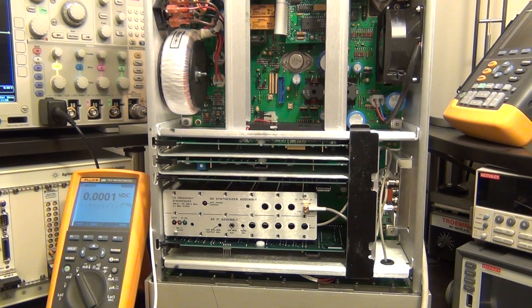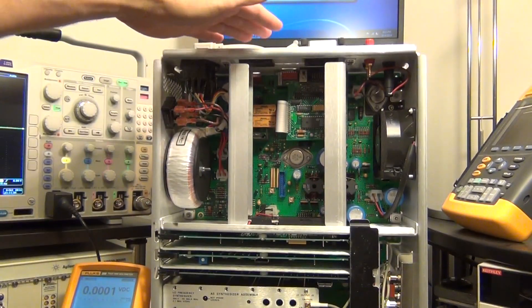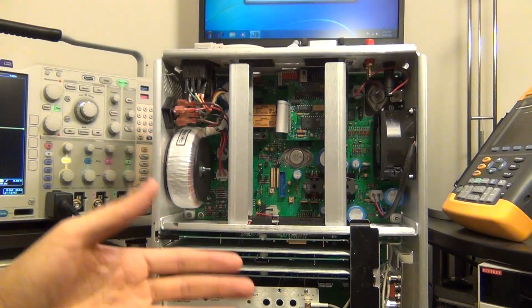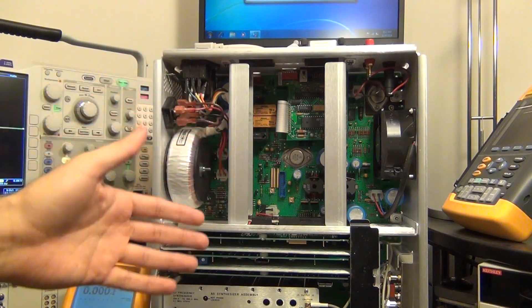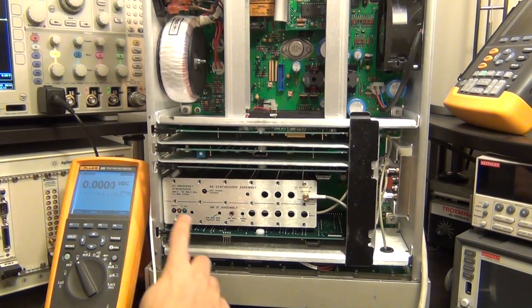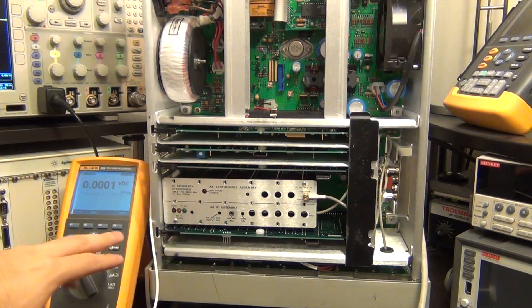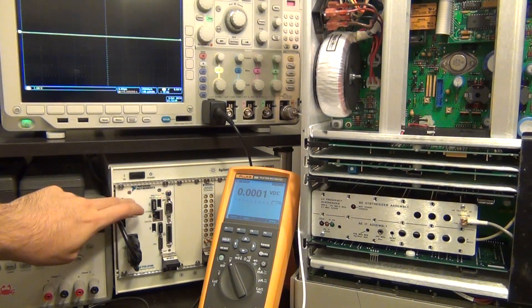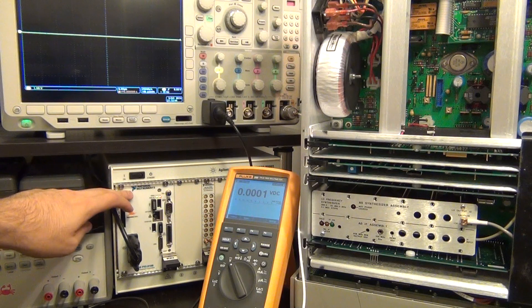You understand what it's doing based on what we discussed — the frequency is rapidly going back and forth, looking for a possible RF frequency to catch. Look how fast this MDO works. Because it's capturing such a wide bandwidth, it's not sweeping in this range — it's all one capture, so it's really, really quick. So you can see it going back and forth — it's working really well. The amplitude is reporting around 13.5 dBm, which is also correct — it should be 14 dBm. The best way to confirm is to invoke the diagnostic GPIB command, set it to a fixed frequency. Then we can see its amplitude, look at its phase noise, and confirm it's locked. I don't think it's the synthesizer that's the problem — although I wish it was, because that's much easier to fix.